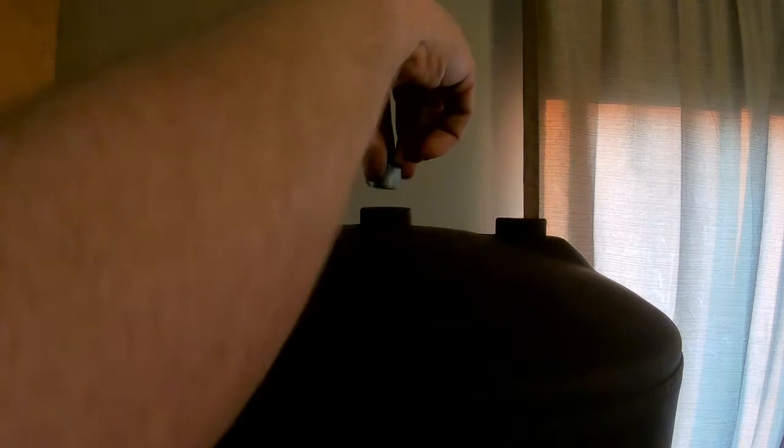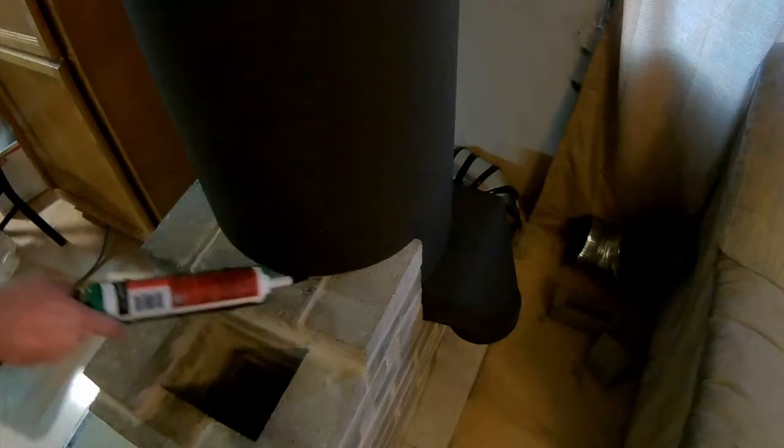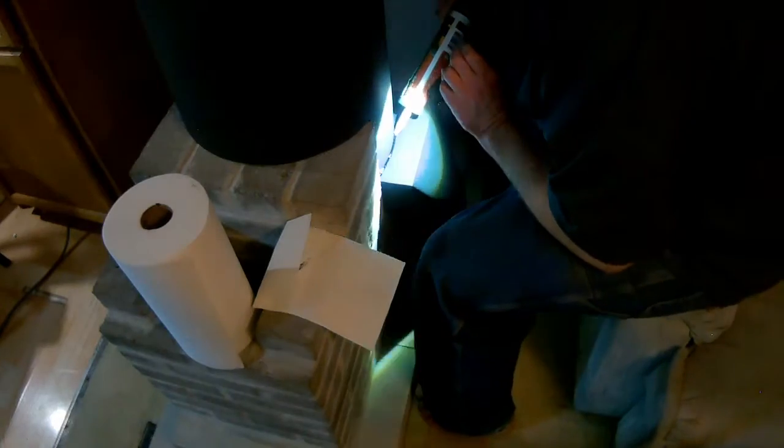I ordered these thinking it would be really nice to have a cap that would sit flush in here. I got a wrench on them and did everything I could, but that's as far as they go in — it might just stay like that forever. I'm going to put some silicone sealant around all of these edges, because the riser inside is actually where the power comes from. Inside there is going to be an under-pressure from the heat riser, so anything unsealed here will just leak.